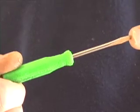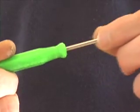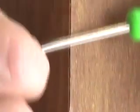Now, what I use to repair that is something real simple. A little bitty screwdriver. It has a round shaft on it. It doesn't have to be a screwdriver, but pretty much anything with a round shaft will work. To work that corner, I take the round shaft of this small screwdriver and, working it ever so gently from both sides, I start to rub these two pieces of wood together. Anybody who's worked with birch veneer plywood knows that if you take a piece of sandpaper to this, in no time at all you're through the veneer, and then the stain doesn't take right, it doesn't look right.